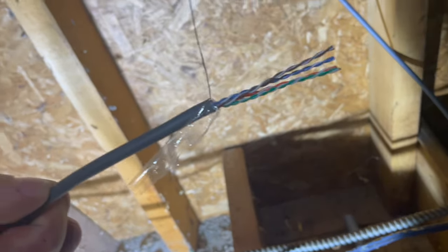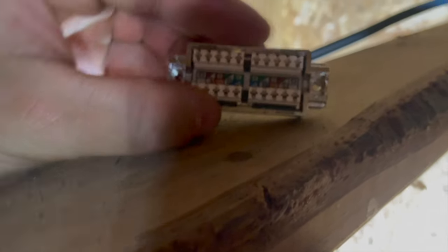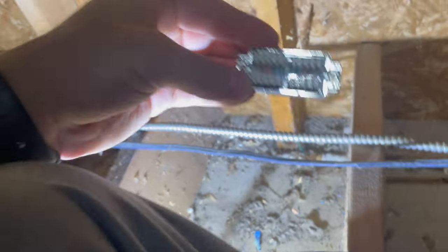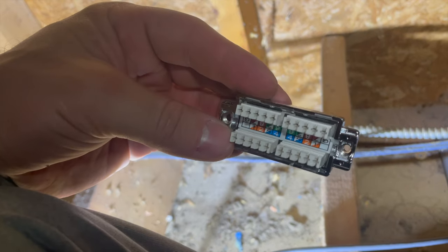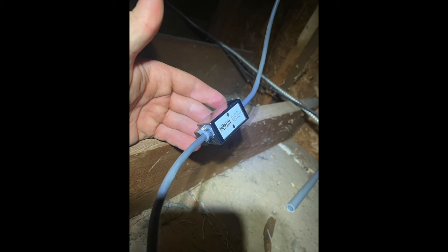I'm looking in the attic where I'm going to make the connection between the two wire ends that I cut. If you're not familiar with this type of wire or how to do this, you can watch more videos — you do need some specialty tools. I'm using this junction box, which connects two wires together. There are different methods, but you're going to need a punch-down tool for this. It doesn't take too long and it's a pretty secure connection. This is what it looks like afterwards — capped it.